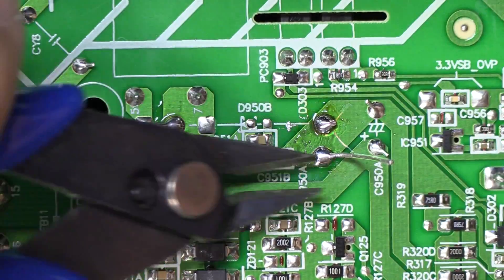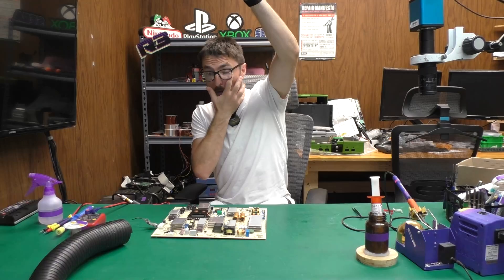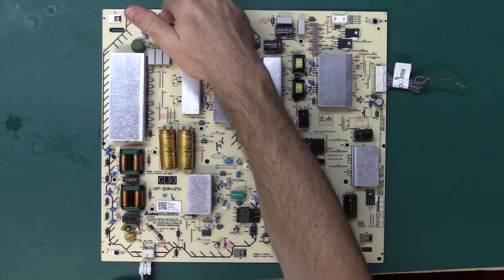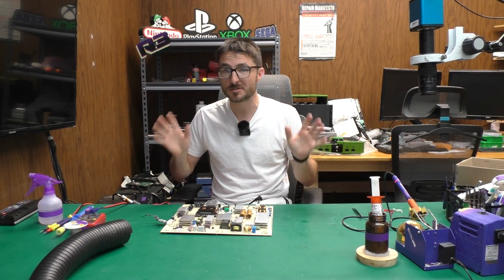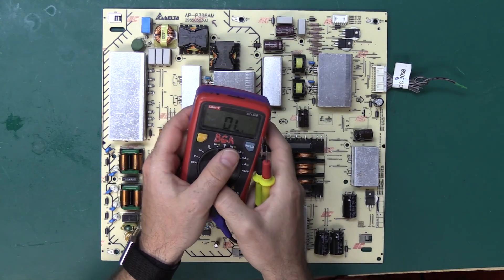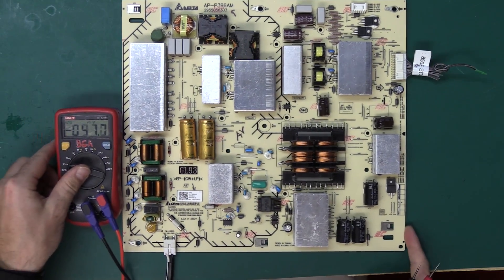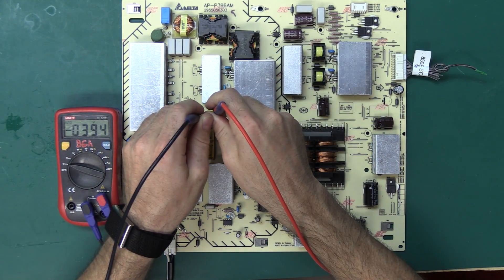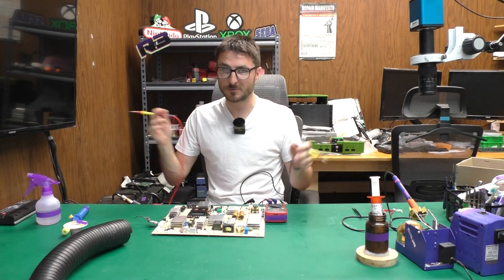We'll cut off the leads. If I did my job correctly, the unit should now boot up once we plug it in. I never removed the jumper connector so that's still plugged in — and it just clicked. It was not clicking on before, so that's a very good sign. We're going to change our meter from continuity to DC volts. Are we getting our 380-390V we're expecting? And we are — 393 volts. So that does mean we have fixed it.